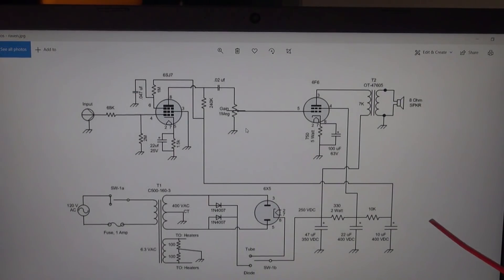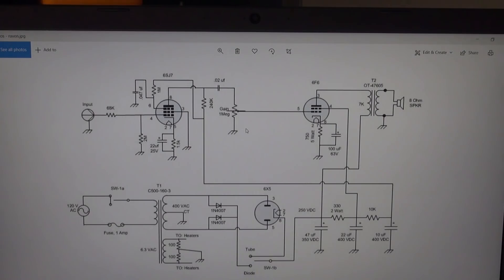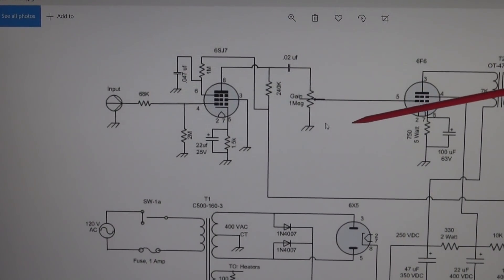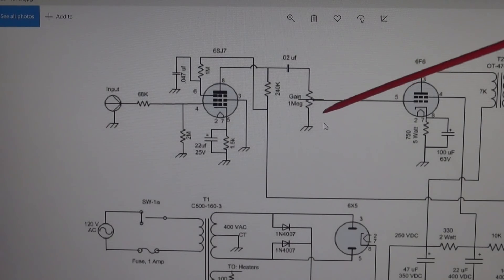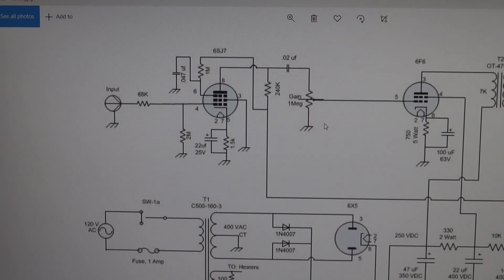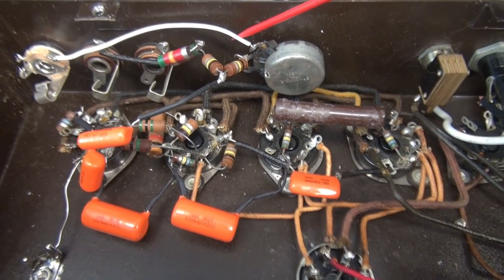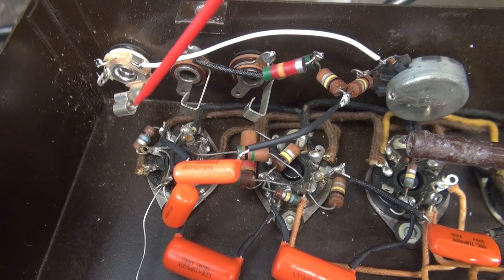Here's the plan. This schematic is of my Raven amplifier — some of you may be familiar with it. It also uses a 6SJ7 as a preamp tube, but that's not what we're going to mess with. Look over here at the preamp side — the volume control is after the preamp tube, and that feeds the output tubes. That is what we're going to do to this Gibson amp. We're simply going to rewire the volume control from the input to the output side of the 6SJ7. I guarantee this thing will be as quiet as can be when I'm done. There is that volume control with the low side not connected. I'm going to swing that wiring to this side of the 6SJ7. The inputs now will be wired direct to the input grid.